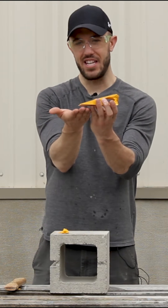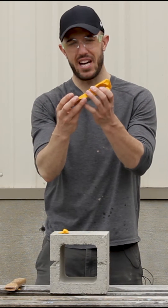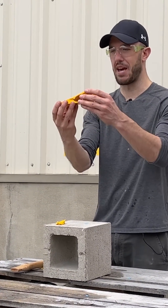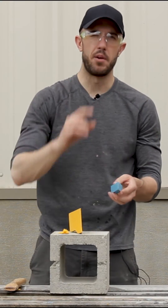So that alignment, even though it technically makes the front blade a little bit sharper and you would sometimes almost kind of consider it to be stronger because you have planes of material out that direction, kind of like a laminate — it's not as strong as the blue one. We have one more test though.